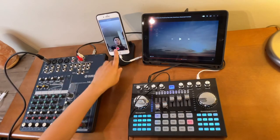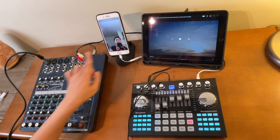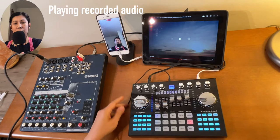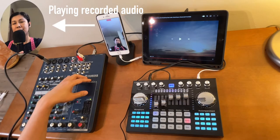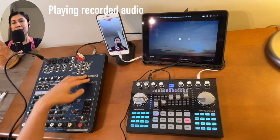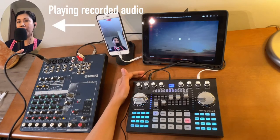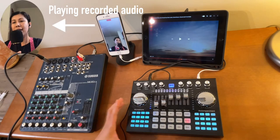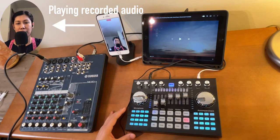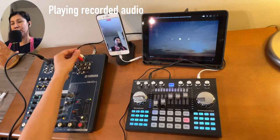Let me start recording again to share the audio you're hearing from my headset. What you're hearing now is the vocals and audio coming out from this mixer connected to this K1 Live sound card. From the mixer, the REC OUT port is connected with this RCA cord, and the other end — the 3.5mm TRS with two lines — is connected to mic one or two of this K1 Live sound card. Everything else should be the same; the only difference is we used a different cord.